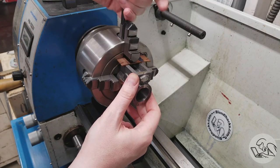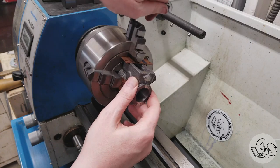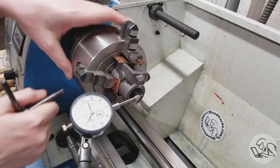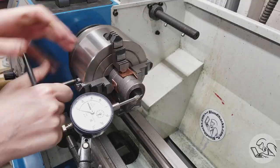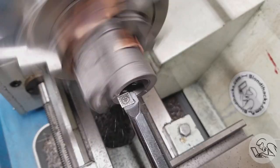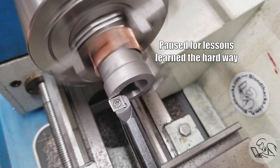I flipped it over and seated that machined face up against the chuck face, thinking it'd be easy to just face the other end. However, tapping it in is pretty ineffective because of the rough irregular shape of the casting — the part can't move in the jaws so it stays fairly crooked. I decided to face it off anyway, thinking this is the outboard end so it doesn't actually matter if it's a little bit crooked. I hadn't yet realized my mistake. At this point I'd created a bunch of problems that all could have been avoided — I had squared up the other end using the Keith Appleton method so that end was very square, however it was the wrong end.